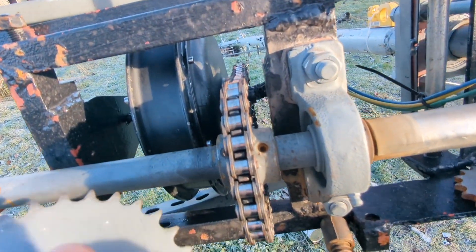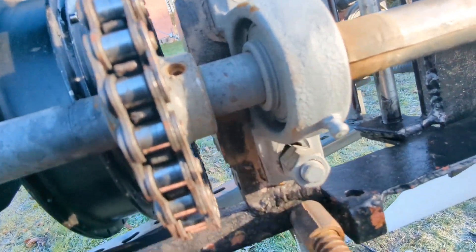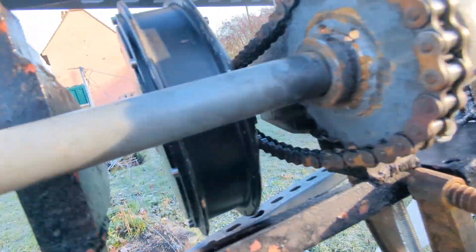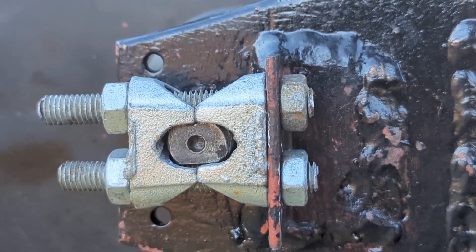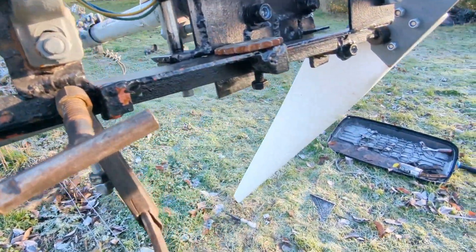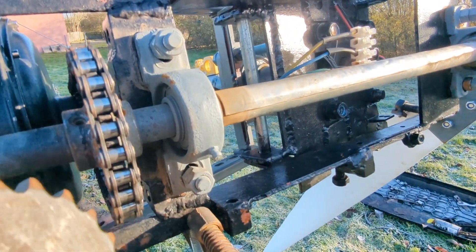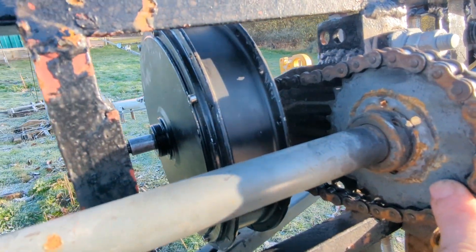I have got a 37-tooth one but I'm just going to try with this one at the moment. There may be a situation where when this one is shifted over it comes into contact with the metal on the frame plate — if that's an issue, thick washers underneath the bearing housing can lift it up and give some clearance. That's the plan. If I can drill it I will; if not I'll have to weld it, and that will allow us to run two separate speeds without taking the driveshaft off, which would be awesome. Unfortunately it does mean two new chains will need to be made up.